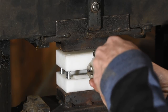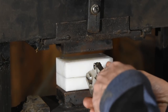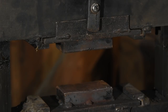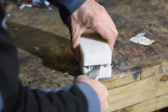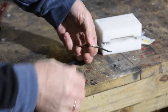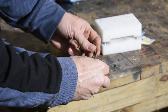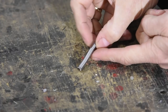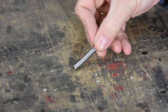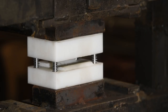Let's see if the whole thing even works. Oops, it's stuck. Well, first the good news: the part came out perfectly, so we got that. But dummy here forgot that I had meant to shorten the guide rods so there was sufficient clearance that they didn't get squashed by the press. Good news is there's no permanent harm to the die — the flexibility of that PTFE saved us here. Five minutes to replace the guide rods and we're back in business.